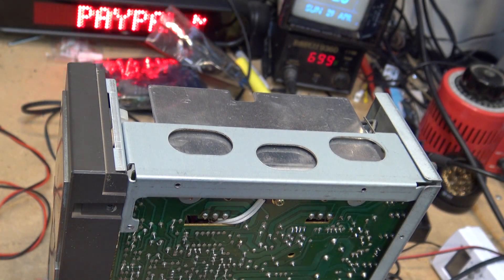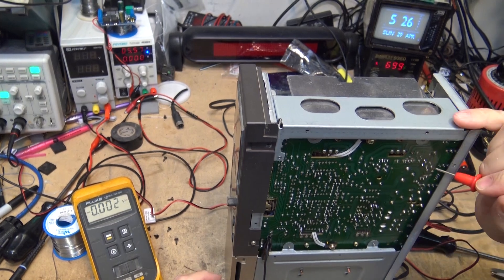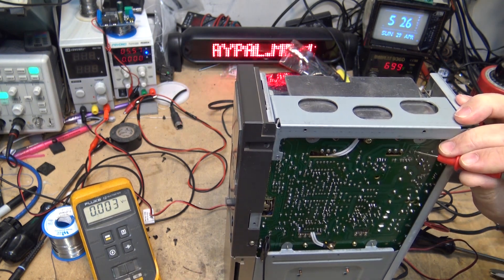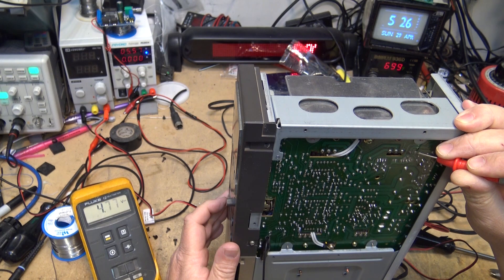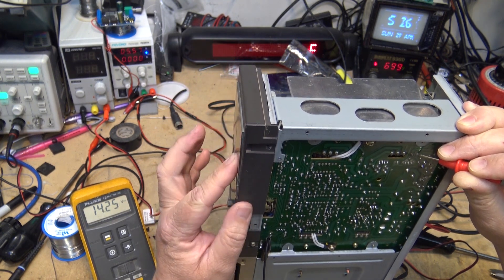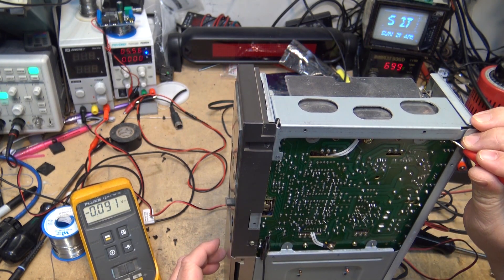Now if I monitor the charge voltage to the protection relay drive transistor, we should see the charge voltage rise. That resistor I just checked and it was okay — it provides power to this Zener diode, which also goes down to this resistor I just unsoldered that goes back up to the circuit that will ground it out. I just want to see whether the voltage will rise above three volts. It does. We still have no control of the volume though. So now we know why this thing is being held down — this protection circuit is triggering.